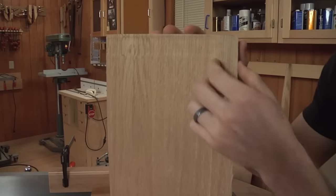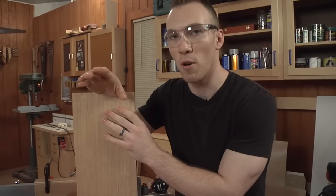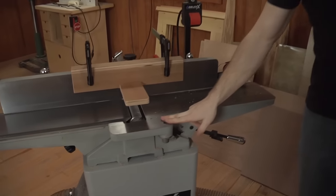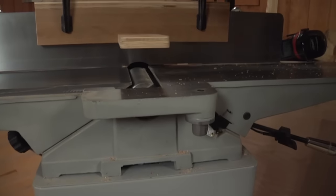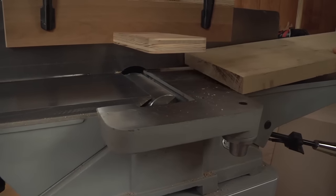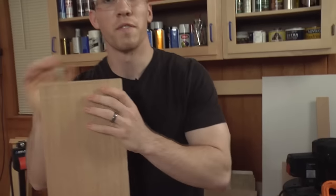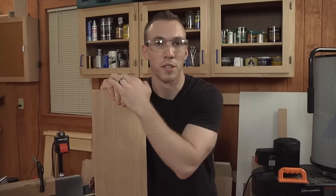As you can see, we've got a rabbet just along this edge — very shallow — and there are flat points pretty well all throughout this rabbet. If you didn't get it perfect on the first try, there's going to be a little trouble running it again. The issue is that these jointers have rabbeting ledges, and the ledge you just made will hang up on that if you try to run it again. That's okay, as long as you have two flat points along the length of that rabbet — the spacer we're going to put in there will work just fine as a reference point.